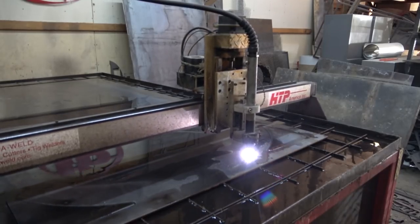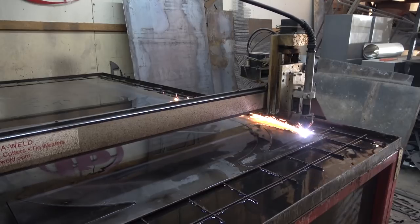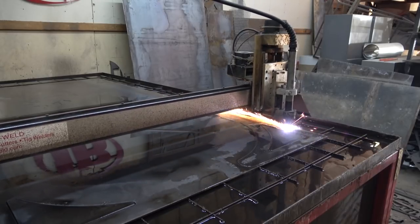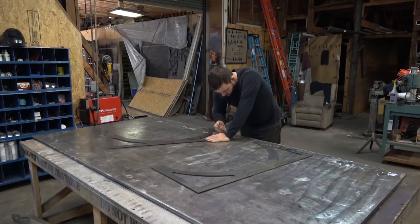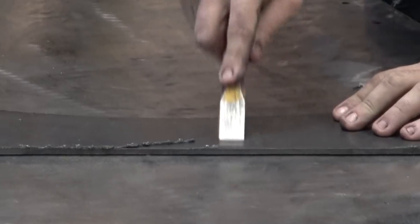Normally I see it coming before I actually have a burnout. The sound changes a little bit, you get a little bit more sparks on the top of the plate. But with 3/16s, you get sparks anyway, so it's just kind of the name of the game.